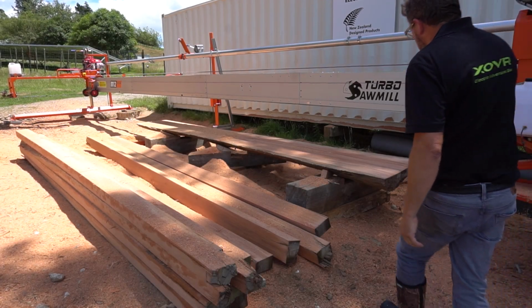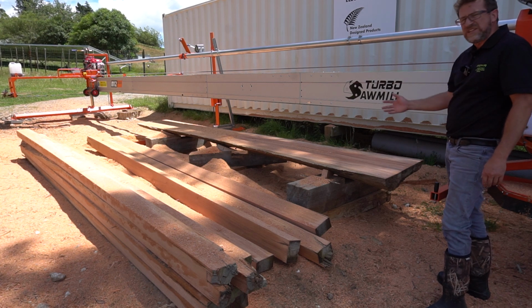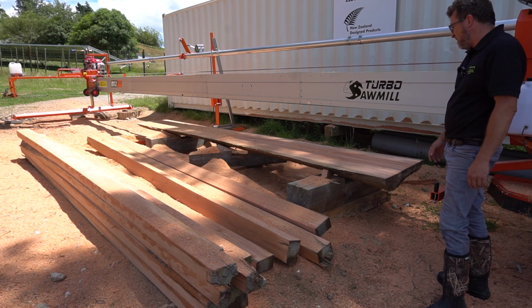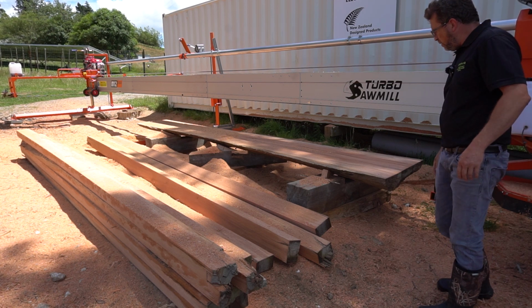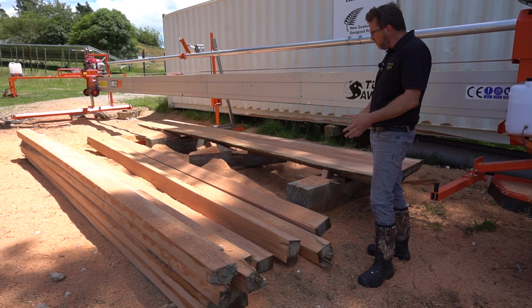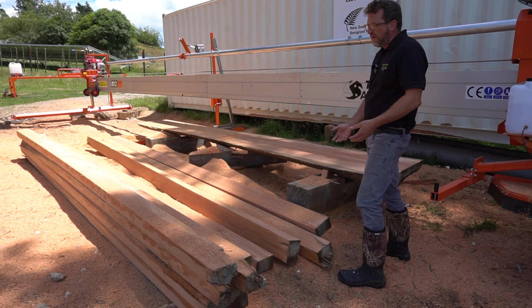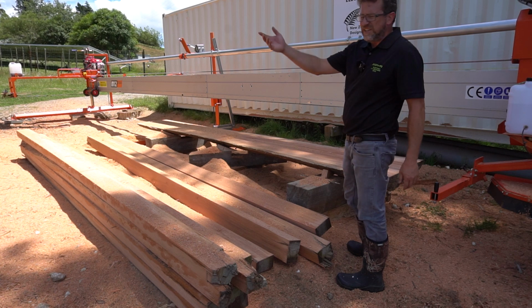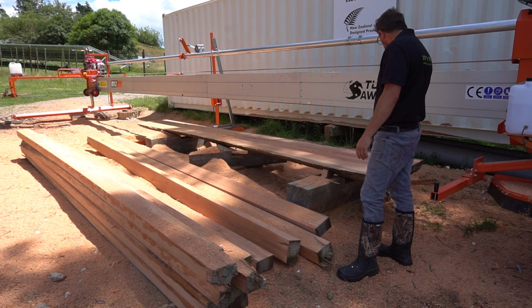Right, so the board return, this timber is very hard, so unless you're cutting like 2-inch stock, 1-inch stock, the capstan drive is just going to slip on you. So, you know, removing big timbers is obviously best, pulling it right beside the saw here. A forklift would be ideal. I've got a digger, so we'll stack this after we're done.